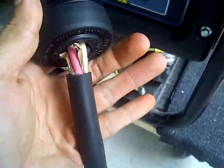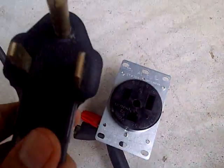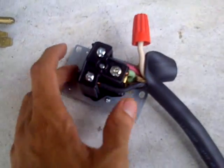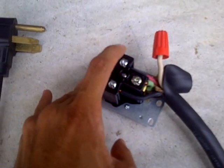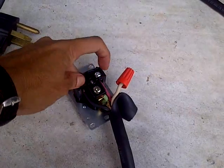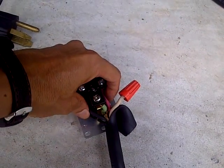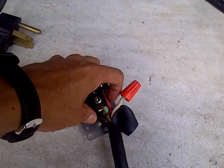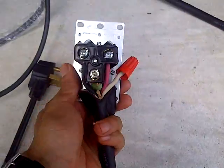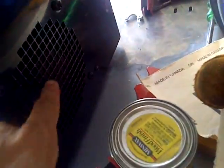But that was the easy part. The hard part was: I've got four wires here, and this is the receptacle to the welder. There's only three connections — the ground, the hot, and another hot, or the common. So at the time I didn't know, and what I did was I put the white wire in here. But basically these are just two hot wires and this is the common. The fan turned on and was going, but it wouldn't do anything beyond that. I could see the fan rolling in there, and it wouldn't go.